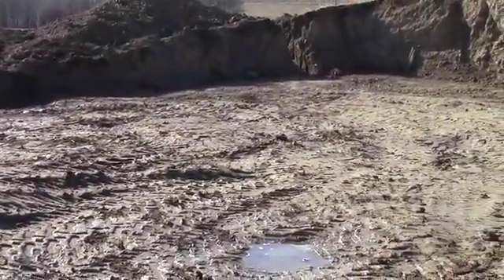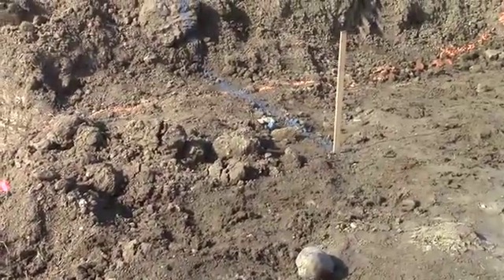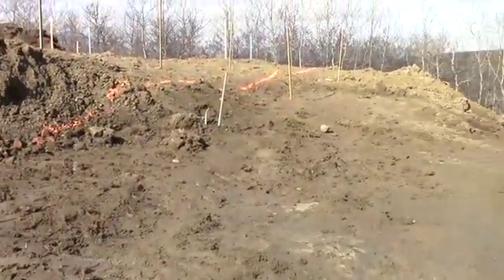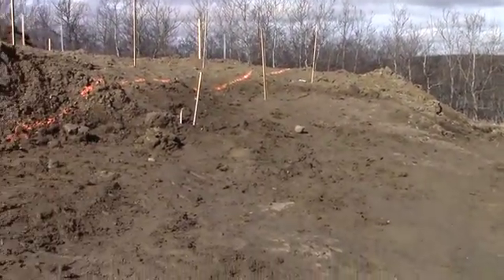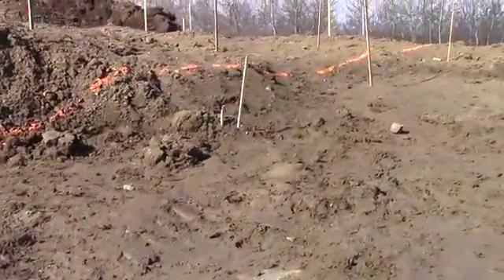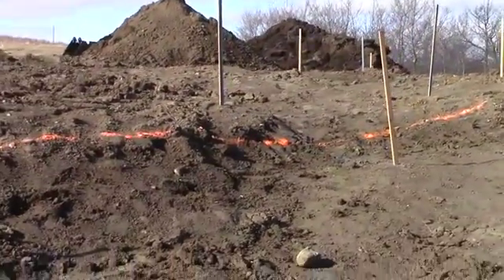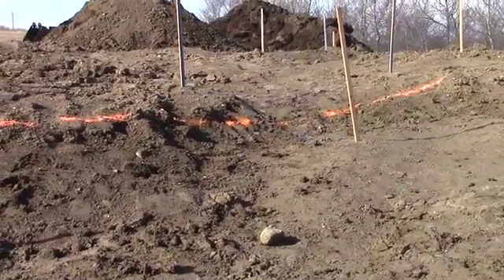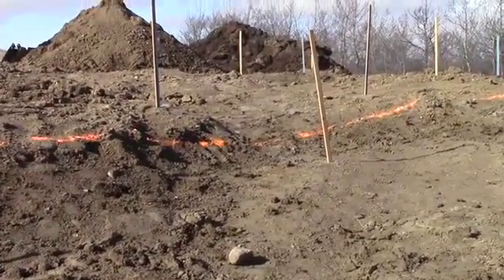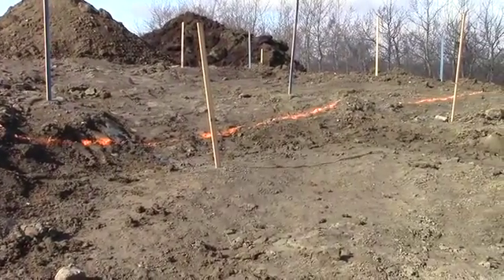Imagine a trench 54 inches in the ground and about five feet wide. We come across and at this first blue mark we come back up — we're past the walkout. The grade of the land goes back uphill, so this brings us step one up 18 inches. There's another blue mark there, that's another 18 inches. The third one brings us to the level of the basement, and when you shoot a laser level around, that mark is roughly a foot of ground covering our foundation.